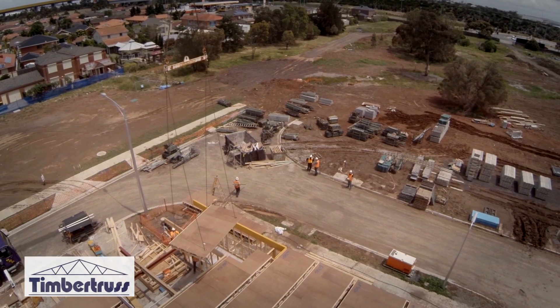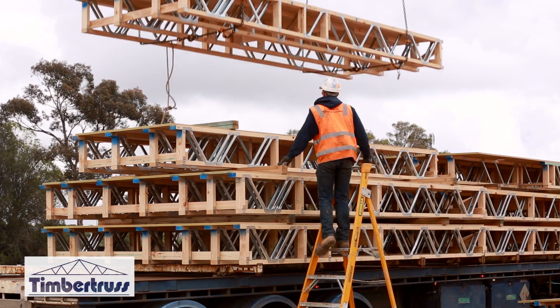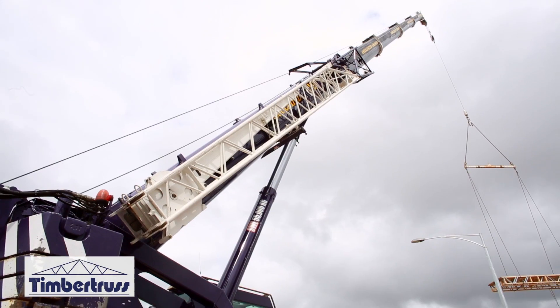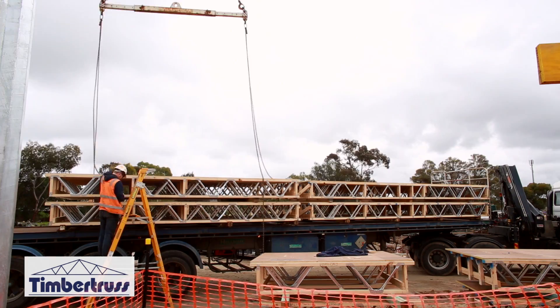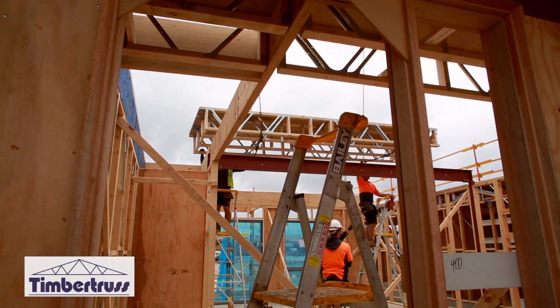I'd call it up a day or two in advance, get the cassettes brought to site, and then install them. The time per cassette is roughly five to six minutes — by the time you sling it, load it, and get it into position on site. You're looking at about six house lots in one day — roughly 47 cassettes — and we can install them all in one day.